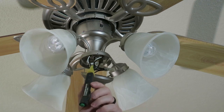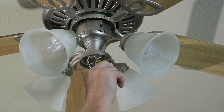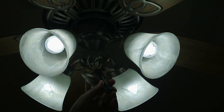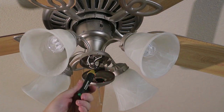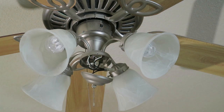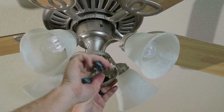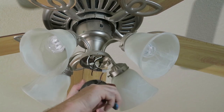So we will check our voltage and make sure that we don't have any power in here before we open it up. I'm using a non-contact sensor - it doesn't have to touch any open wires to tell you if there's power in the system. Now we have the power back on, and you see our non-contact sensor is telling me there's power here. You get those fairly cheap. All right, turn our power back off and check it again - make sure there's no power in here. And there's no power. Now that the power's off, we're going to cut our line coming in there, and we will cut the line coming out of the switch as well.